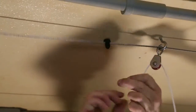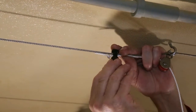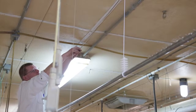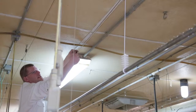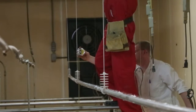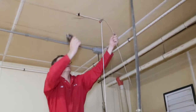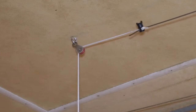Slip the untied end of the ropes through the support pulleys and tie a simple knot at the end. Orient the ropes through the pulleys to allow the corona pipe runs to be lifted by the winch. Attach the ropes to the pull cable using a curtain thumb nut. Tension the rope and the pipe insulator. Start at the rope nearest the winch and slide the thumb nut towards the winch. At the furthest last support of the corona pipe run, attach the rope to the cable. Remove the weight and trim the cable. The cable should not extend through the pulley.